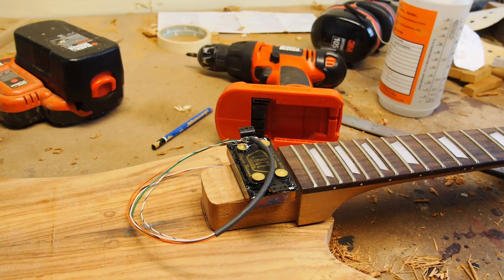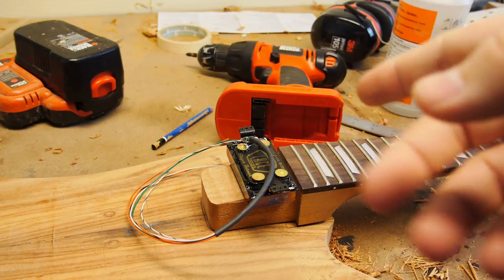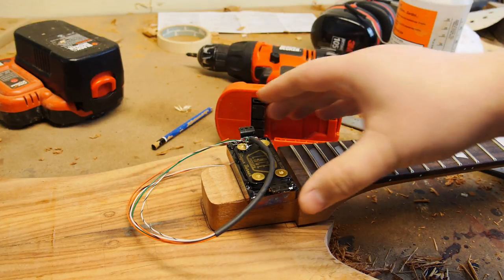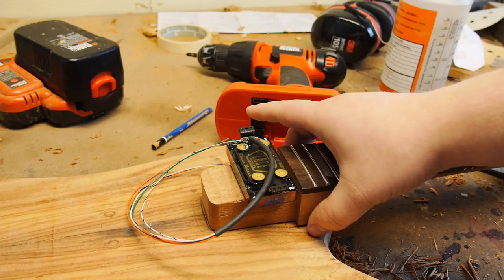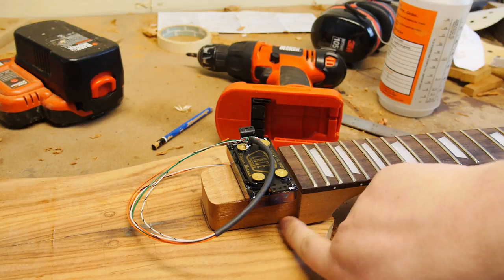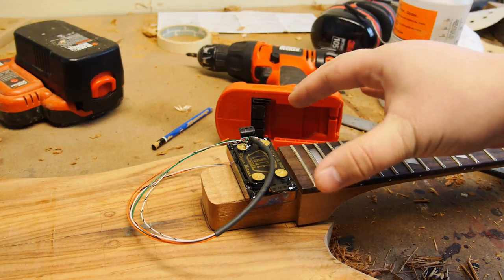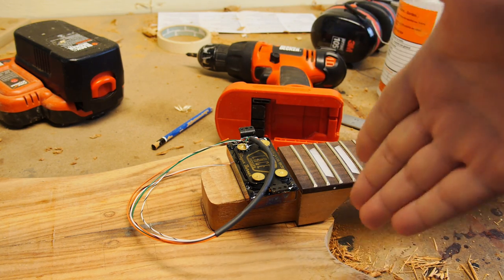What I think I'm going to do is effectively cut the tongue on this guitar neck short, so that I don't have to route out as much. That does leave me with a sticky situation since I don't have as much support as intended, but I think I'll still have enough because I'll have the entire butt here, the bottom all the way in, most of the sides. I'm only going to cut as deeply as I need to in order to fit this neck pickup — I'm not going to go all the way in.